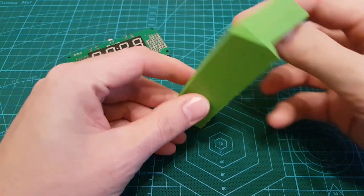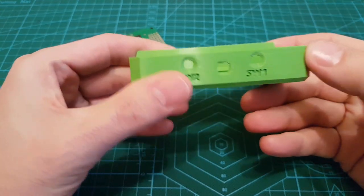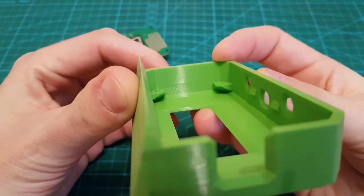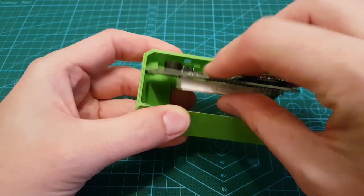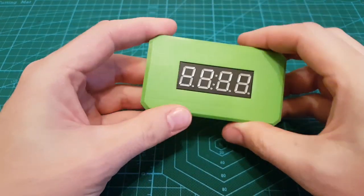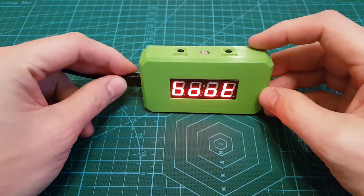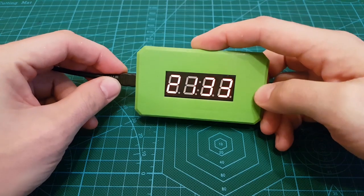Bringing it in to put together, you can see the nubs where the PCB sits and the holes for the switches and LDR, and the little edges that it snaps to. One side has little pegs where the PCB sits into and the other is clear. You put the board in, slide the buttons and the LDR into the holes, and push it down until it snaps — nice and flush with the front of the case. Just plug it in with the USB and it will boot up. It's got a Wi-Fi connection, it will show you your IP and then your time. The LDR is working too.